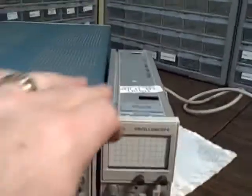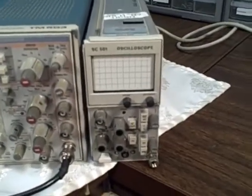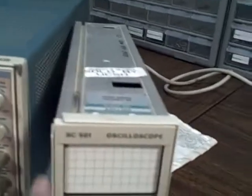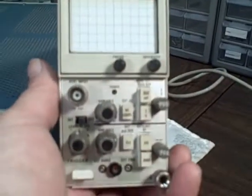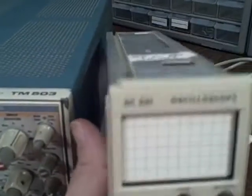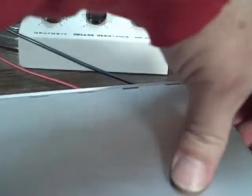And then we come to the SC501 mini oscilloscope. It is a pretty neat looking device, but it does not function right now. There was no power light that came on, so I am suspecting that we have a fault in the power supply. But I will open it up here and give you a look at the insides.